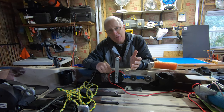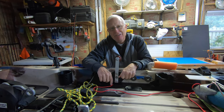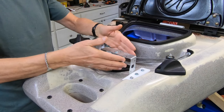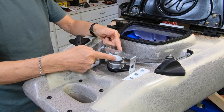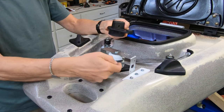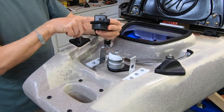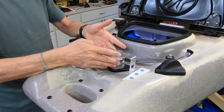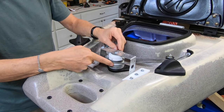Don't cut yourself short like I did, and don't translate that mistake to the other side. The most complex part of the build is the rudder assembly — basically it's a coupler for inch-and-a-half PVC that fits over the top of the rudder cap, connected with a pin that goes through the coupler, through the rudder cap, and out the other side to provide the bite that's going to allow this to turn.